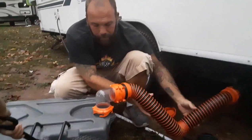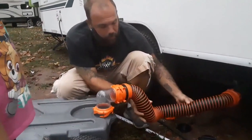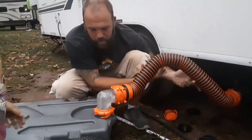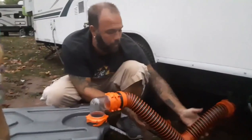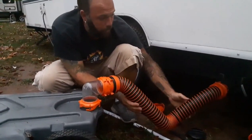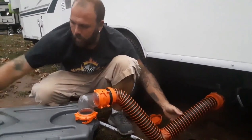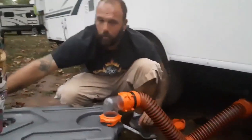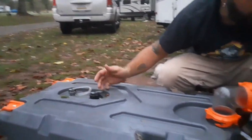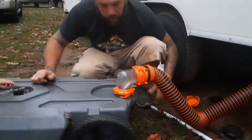I'm just making sure I get a full drain. Normally at this point it would be just flushing through right away - but I want to make sure it's completely drained. With a little play in this flex hose, I'm able to massage through the pipe. I forgot one step - over here is a vent that you turn to open it up, and now it starts to flow a lot easier. There we go, now it's coming through.